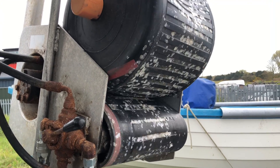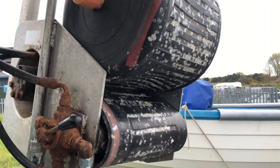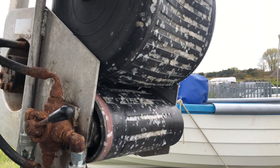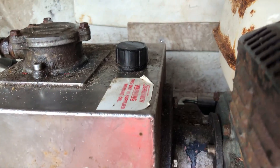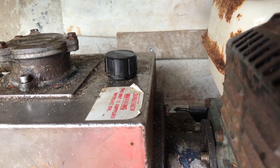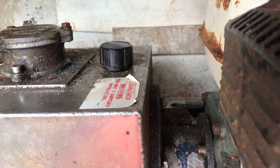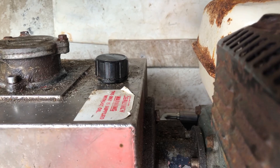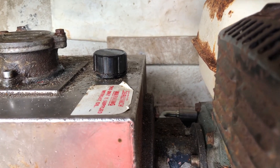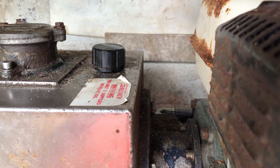As you can hear, I'll start up the hydraulic power pack just to run all the pipes through and get them filled - they'll obviously have been full of air. Run it for a couple of minutes, then turn it off. When you run it for a couple of minutes, take the lid off the hydraulic tank and check the oil - it'll be down probably maybe a litre or so. Fill it up, because these small power packs don't hold a lot of oil. The biggest thing is getting hot - the more oil you've got, the more heat you can absorb before it heats up the whole circuit.